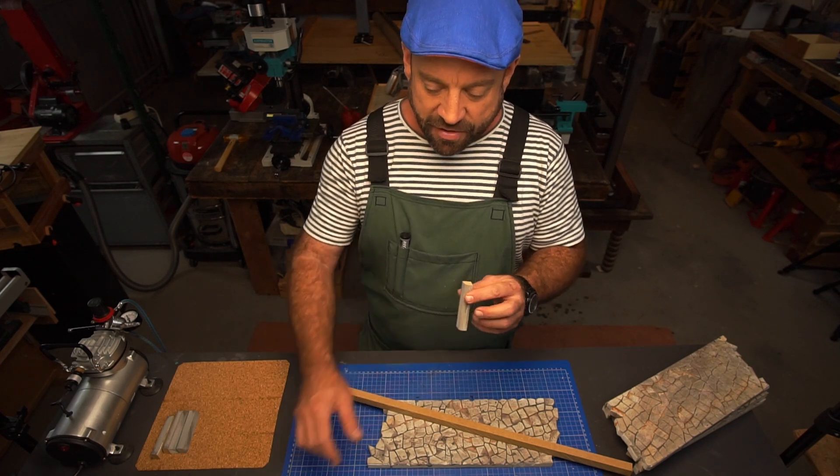Now what we've done is we've got our seven degree angle and we put that little bevel on the edge there. You can see I was a little bit high with my router bit, so that's just something we can easily knock off with a piece of sandpaper — that's not going to bother us at the moment. Then I went through with the chop saw and just segmented it down into even pieces, and that part is more or less done.